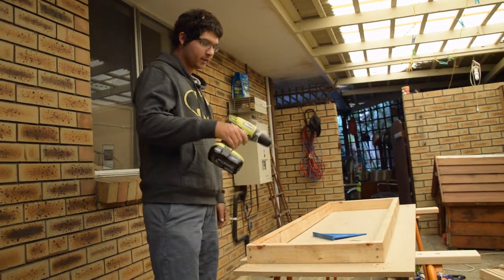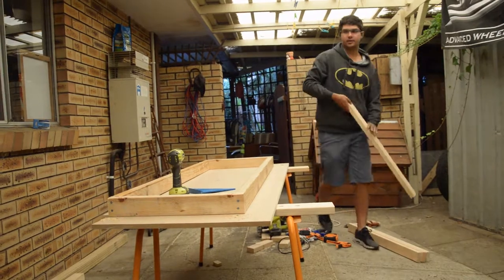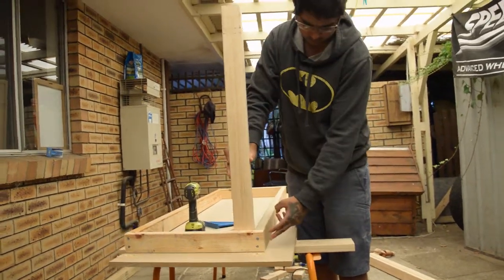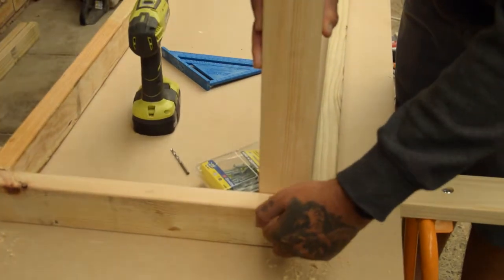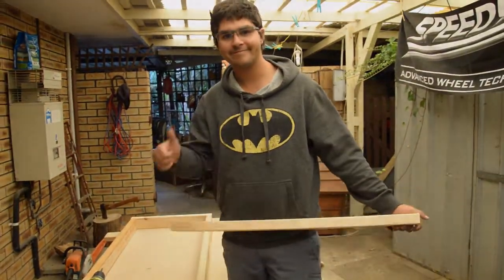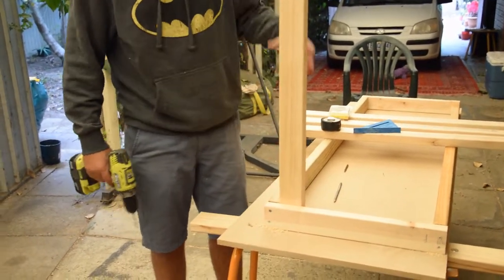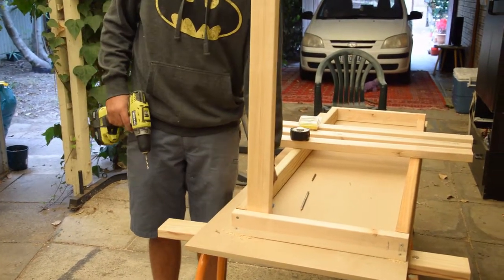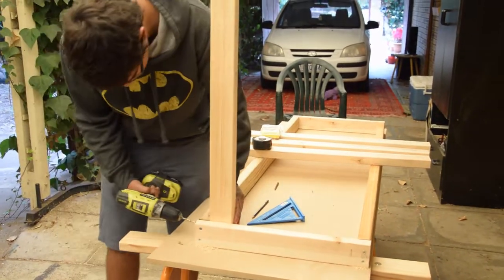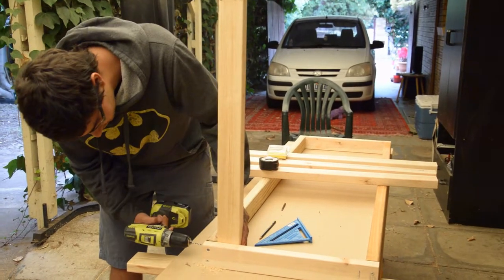Alright, so that's all screwed up together. Now we're going to put on the legs — the legs are going to sit inside the frame we've just made. We're going to screw it twice there and four times there. Now we're going to put the legs on. Just make sure they're all square. Make sure you're missing the screws that we've screwed before, so you just want to screw just under them.